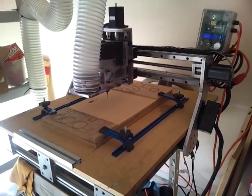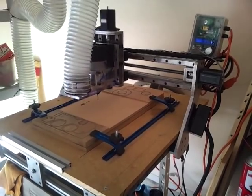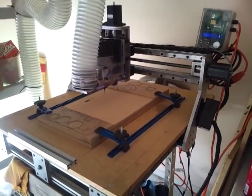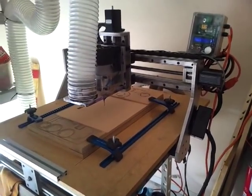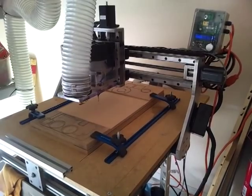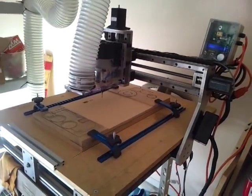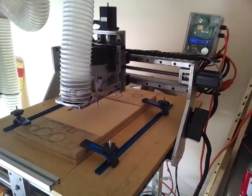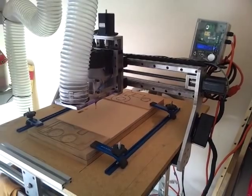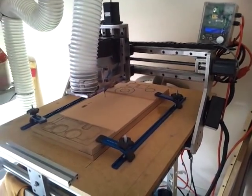I haven't cut this fast at all, but in wood I know it won't be a problem. I would never cut aluminum that fast — the fastest I cut aluminum I think was about 40 inches per minute. And this is an eighth inch step over for the circle.